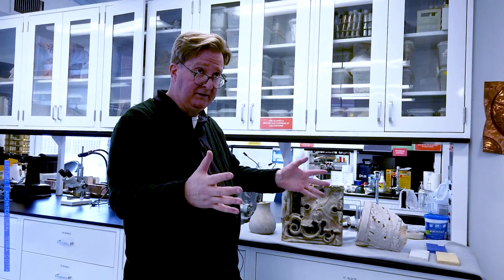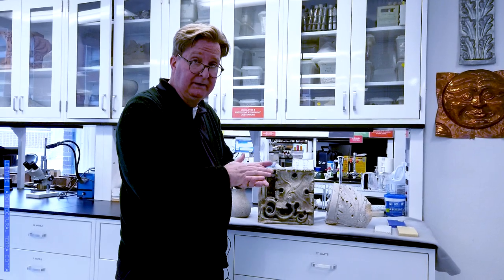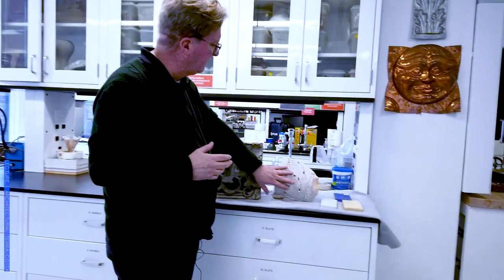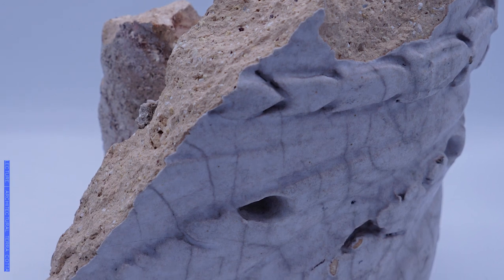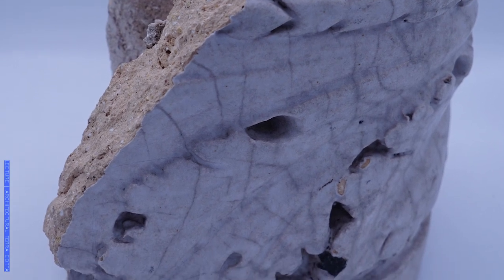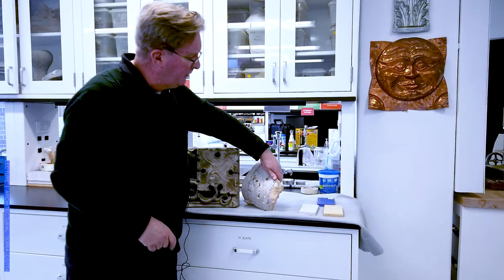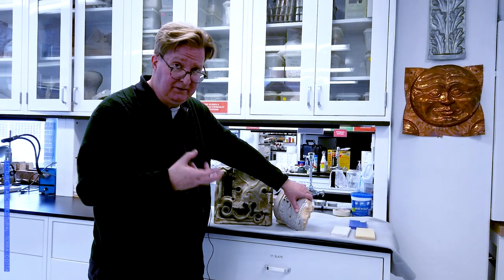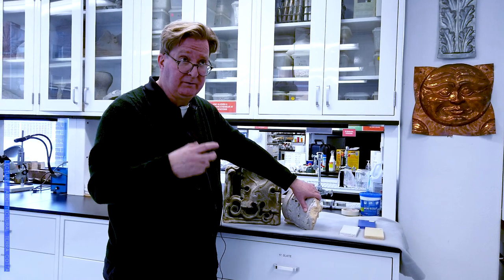We have to make a mold, make a larger positive, a larger mold, and then push it down. We've pressed a lot of terracotta here in the lab over the years with students, and we've had the good fortune of firing many of these pieces at Teachers College in their ceramics lab. Here's an example of a higher-style, shinier glaze. Underneath it we can see the ceramic body, which is a mixture of ball clays and previously fired clay. If you look very closely, you'll see little white flecks, referred to as temper or grog — pre-fired ceramic material mixed into the mix up to about 30%.